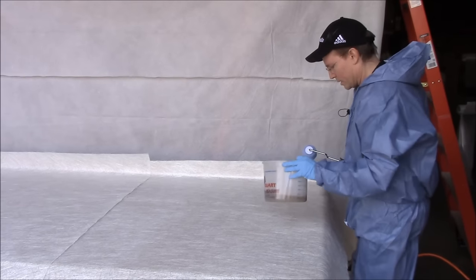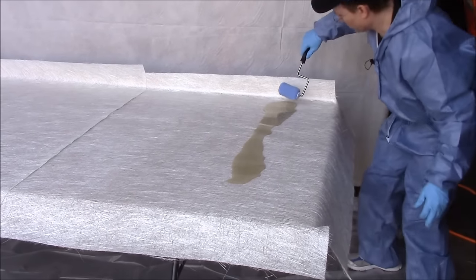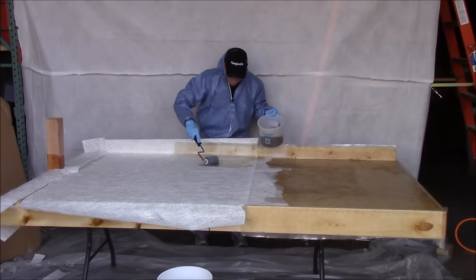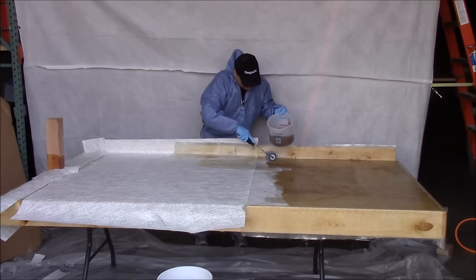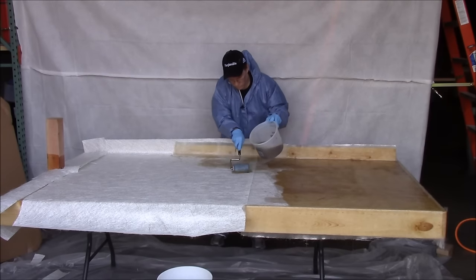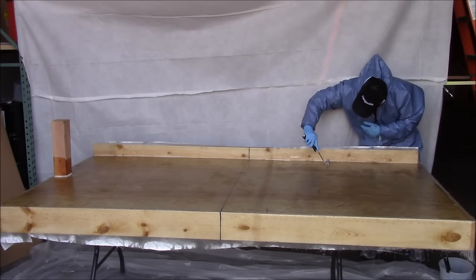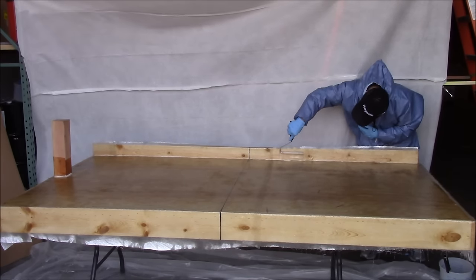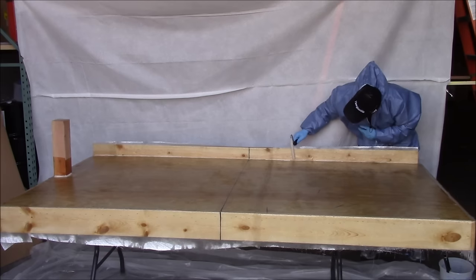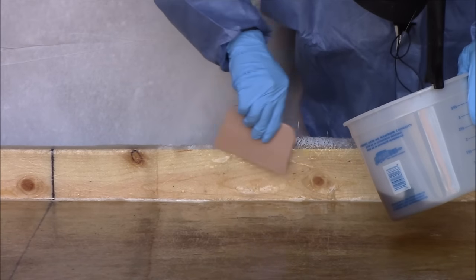Now all the matting is laid out properly, so we're going to pour the resin in a strip and start moving around with the roller. We've saturated the two-ounce mat over the entire deck. As you can see, when the mat gets wet it will go around the corners like it's supposed to — it did around all of the corners. Back where you see the white line, that's not an air bubble, that's the caulk we put across there. It won't matter once we gel coat over it, so clear caulk or white caulk doesn't matter because we're going to put a beautiful gel coat over it.